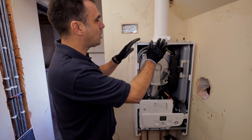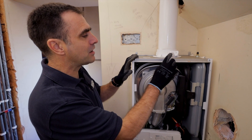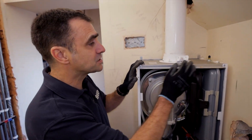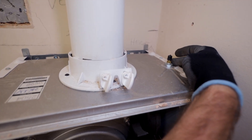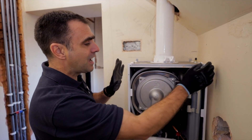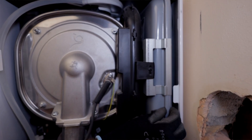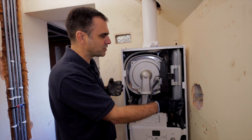Looking at the top of the boiler, we've got our test points — this is the air intake and the flue outlet, nice and simple, easy to test. I've also got my Schrader valve for the expansion vessel outside of the case. I only need five mil of clearance either side, and everything is true front removal. I've got a seven litre expansion vessel, enough for roughly 100 litres of water in the system.